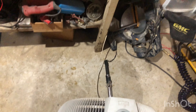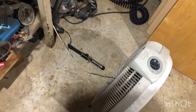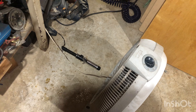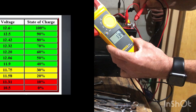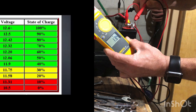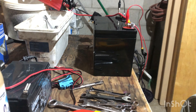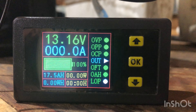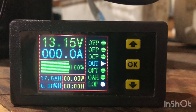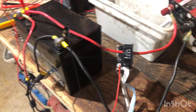I've read various reviews about this battery being at the 10-hour rate being half the capacity of what they're rated for — it's kind of a little trick they do. I will say I've seen some of the Renogy AGMs also showing the 10-hour rate, so it's something to pay attention to. We're going to see if we get half the capacity pulling this thing down to 50%, which would be 17.5 amp hours, and see how well it does.